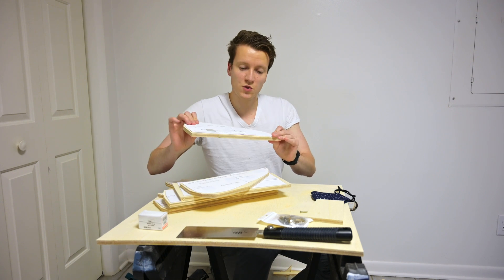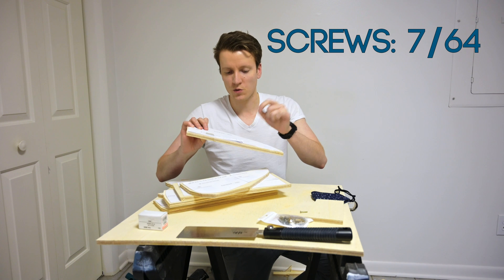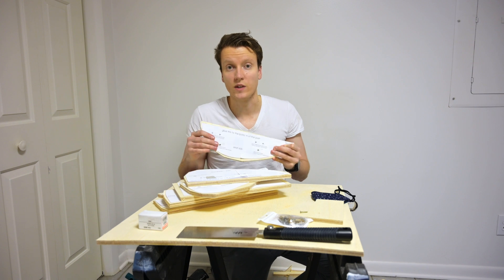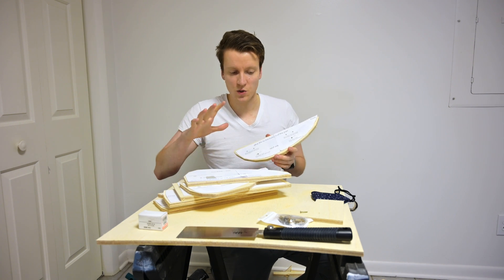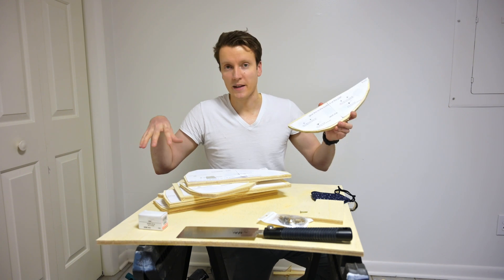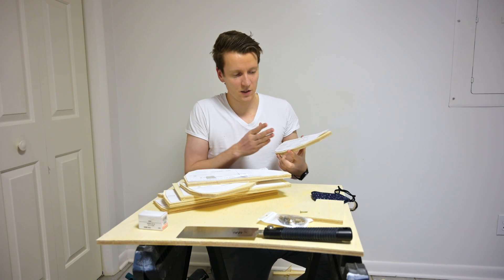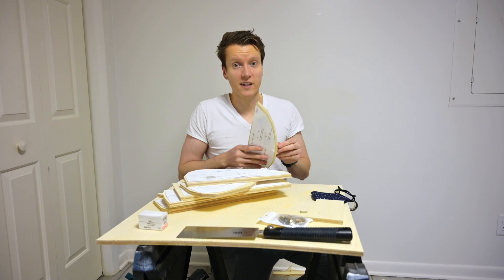It's great with this template that Alex created — it shows you exactly where to put the drill to drill through. Now that we've got all the holes drilled, I used 7/64ths for all the screw holes, and 3/16ths for the wooden dowels, since that's the size of the wooden dowel I'm going to be using. I'm going to take these outside into the garage to do the sanding, because this is going to create a lot of dust in the basement. Then we'll be back in to put it all together.